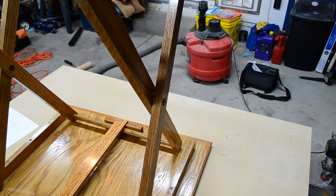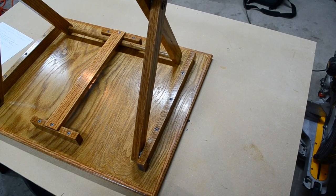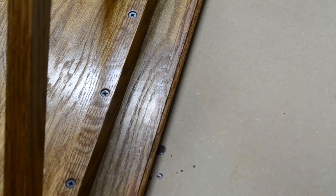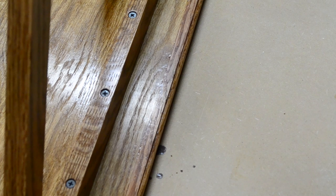For the top piece, I cut it 19 inches deep by 24 inches wide because I wanted the larger tray. This wood is not solid oak — it's oak plywood — but I edged it with solid oak edging, and when you finish and trim it correctly, you almost cannot tell the difference. There is a slight difference, but as far as eating on it, it provides a nice even surface with a little decorative edge.